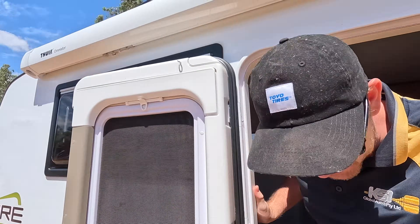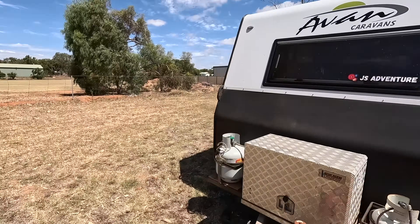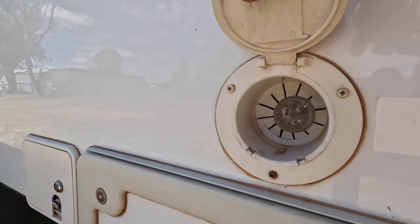This is completely off-grid, not connected to any power at all. In our first little caravan, the Goldstream pop top, Sosha's biggest request was 240 volt power for a hair straightener and hair dryer. So I needed an inverter — our first was a King's 1500 watt inverter which was great. We managed to run it pretty easily without hardwiring, just a simple extension cord into the inverter outside running into the caravan plug with an RCD breaker. We went near halfway around Australia with it.